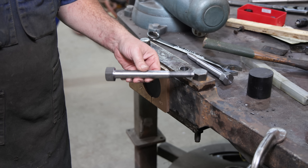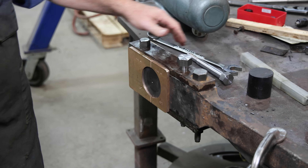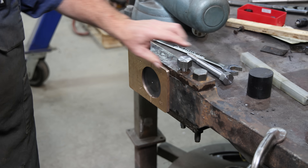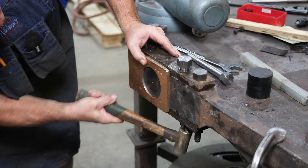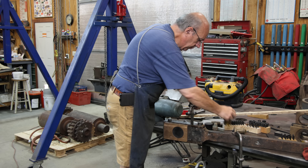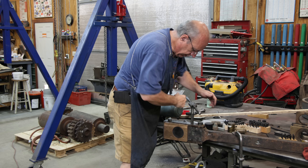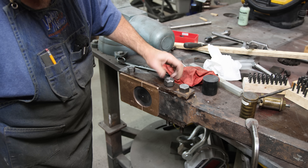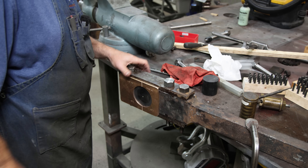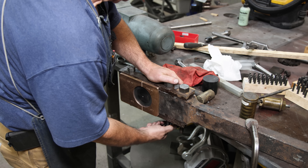I made off camera the new tapered bolt here — this one is a quarter inch taper per foot. Let's see how it fits. Kind of tight here — let's see if it'll hammer down. So I'm going to have to get the reamer and ream it out just a little bit more, but we are real close. I put some oil in there and got the reamer going again — doesn't need a lot. We've done some reaming and that bolt is down real tight now. Just tap it in place and we should be good to go. So now I need to knock this bolt out up front and do the same process on it.